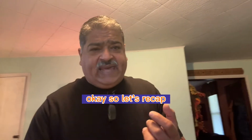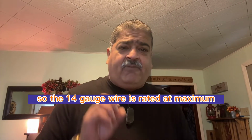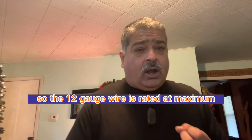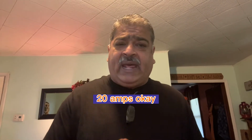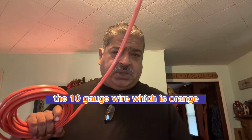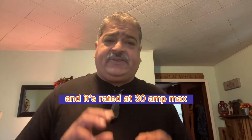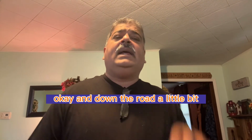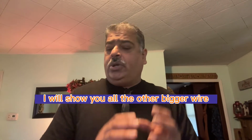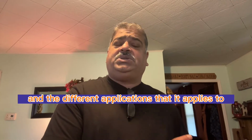So let's recap. The 14 gauge wire is rated at maximum 15 amps. The 12 gauge wire is rated at maximum 20 amps. The 10 gauge wire, which is orange, I forgot to tell you, it's orange, and it's rated at 30 amp max. And down the road a little bit, when I make some more videos, I will show you all the other bigger wire and the different applications that it applies to.